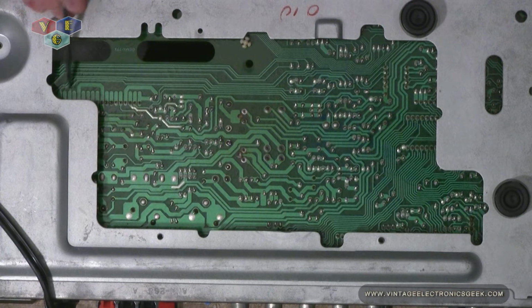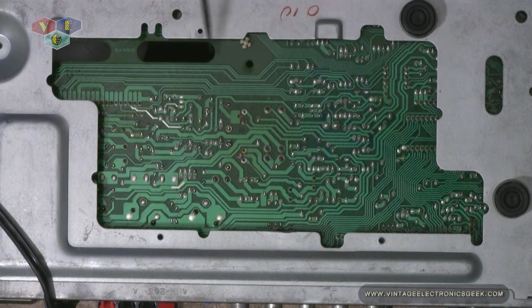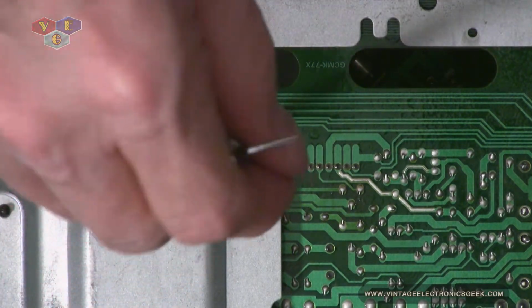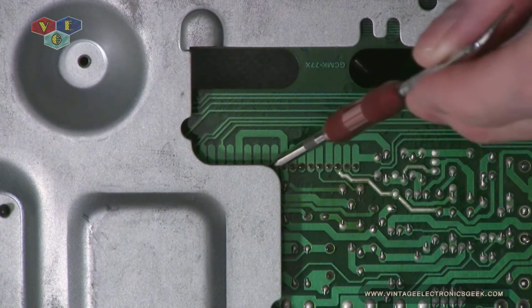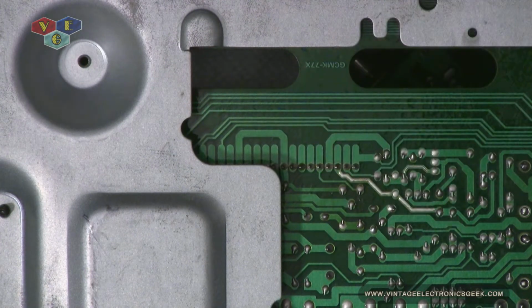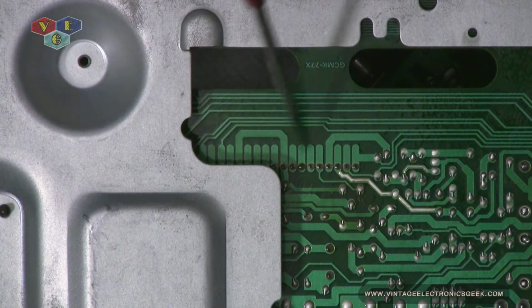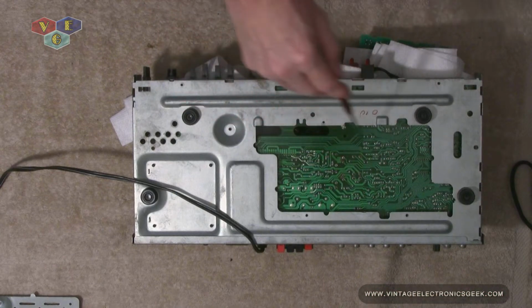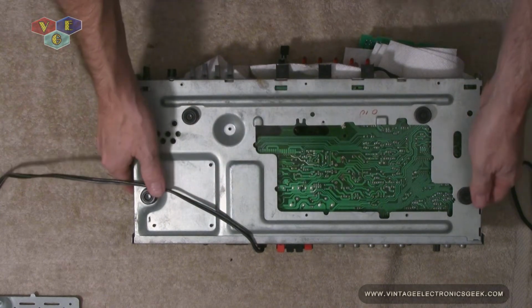Now, pray tell, how in the world are you going to take this out? What in the world is this service bay for? I mean, really. And here's even a tighter shot, just in case you wanted to see it better. You can see that you just can't get your soldering iron in there to pull it out, even if you wanted to. You'd have to go at such an angle that you're not getting your iron to seal around there, or if you're using a soldering gun or whatever, you're just not getting that out of there. So in order to remove this board, I'm going to actually have to disassemble and remove this completely out of the chassis.